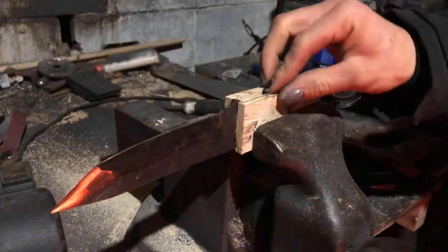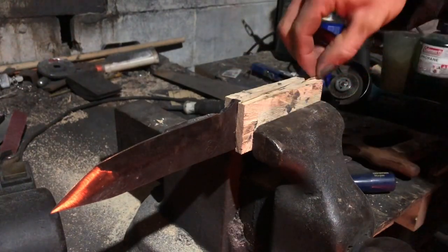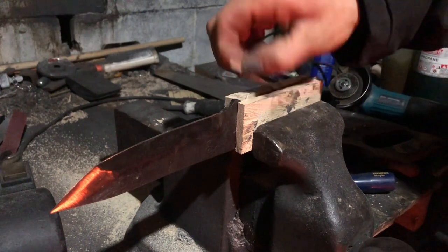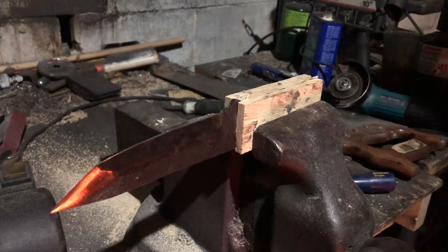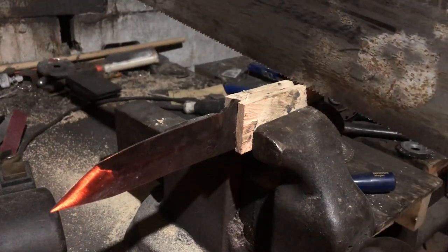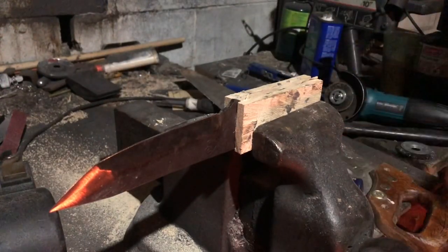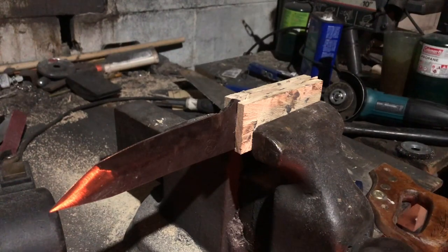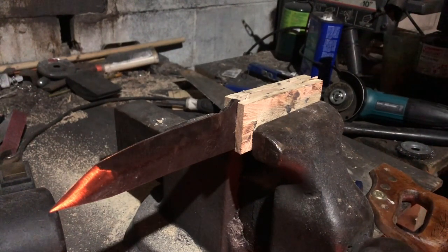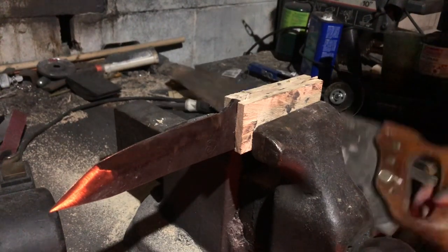Okay, now that I have my two scales glued on, nice pins in the middle, I have to shape them, and I find the fastest way possible is to take a handsaw, like this ancient one, cut slits in it, take a chisel and knock off a bunch, then take a farrier's rasp, which I don't know where one is right off the bat. Oh, they're across my shop. Go figure. Then just take those, file things down, and finish off with a belt sander. Let's go.